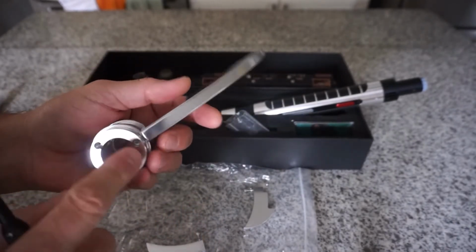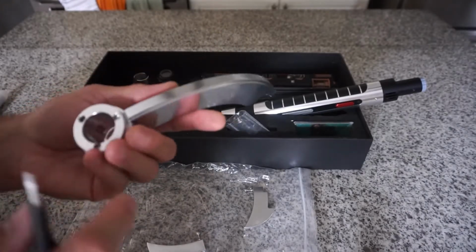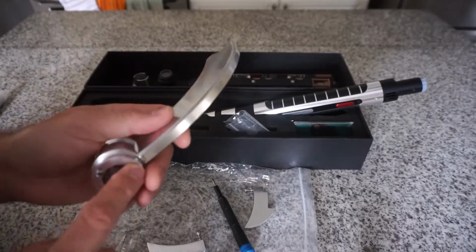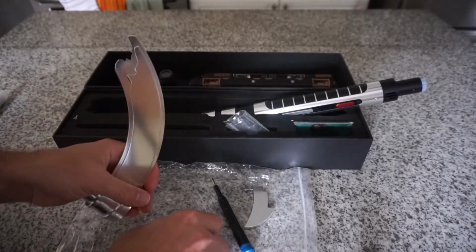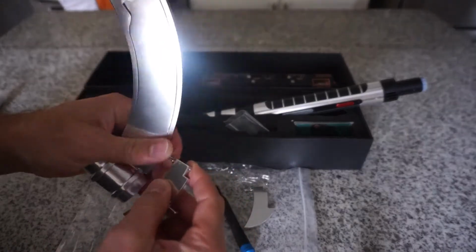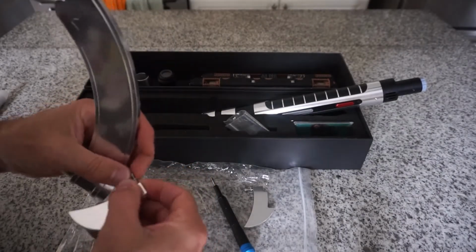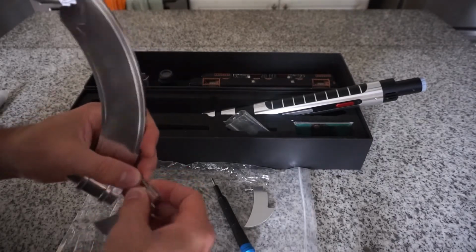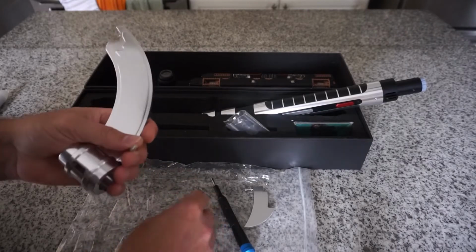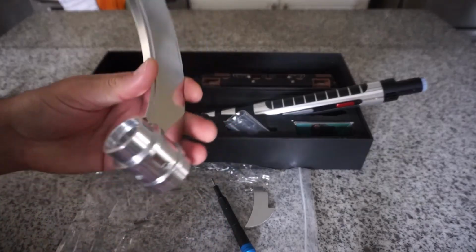Put a small little bit on the tip of the screw. Not a lot, just a little bit, because you won't get it out, especially without stripping this. That'll really help make sure that these screws don't loosen over time. I'm not saying that they will, because it has this lock washer on it, but the blue Loctite will really help. Do not use red. Red is permanent. Blue is at least considered temporary, and that seal will break. Plus, you could always put heat on this if you had to.